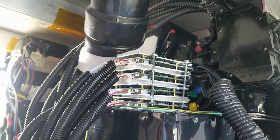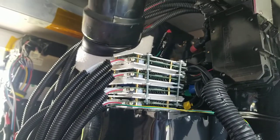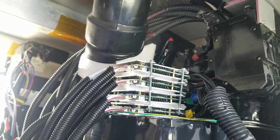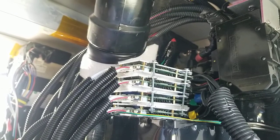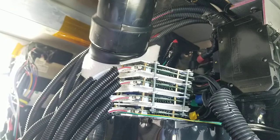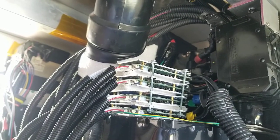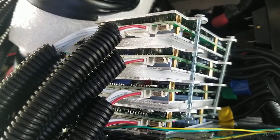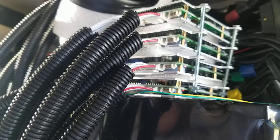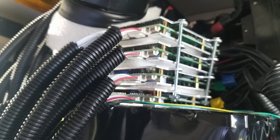Now the battery management system, if you were to drain it down and then leave it alone, will actually turn itself off. That would be if you put this thing into deep storage and the battery went completely dead because it's inside somewhere not getting any solar power. To prevent the battery from damaging itself by having that tiny LED light drain it down to zero, which would take a super long time but could happen if it were in storage for years, you plug something into that little port right there. There's a USB end and a little 9-volt end, and you plug it in there, and that will wake the system up, because it will have put everything into a deep freeze.